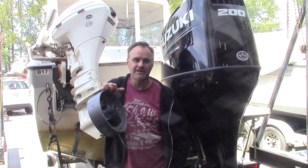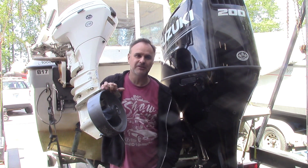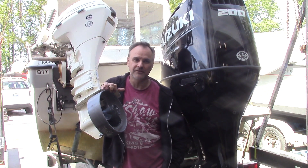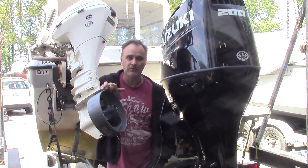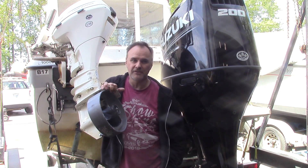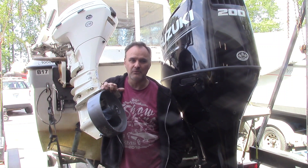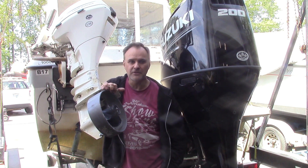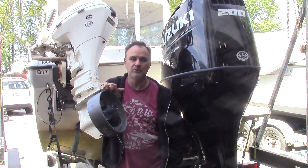Hi, I'm Brad from An Air Marine. Today I'm going to talk to you about osmosis on a boat. Osmosis is the process of water slowly permeating through the gel coat and reacting to the fiberglass, forming bubbles on the surface. This can happen in salt water or fresh water, but it's worse in fresh water because fresh water will permeate through the gel coat easier.